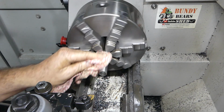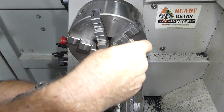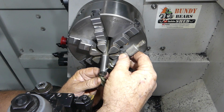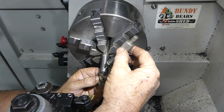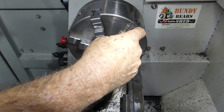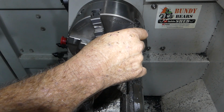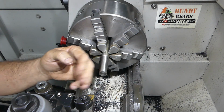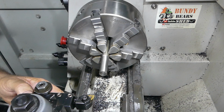Now I know in the past I've tried to just polish a half a thou off, and sometimes it takes forever. So I'm not highly excited about that idea, but anyway, I had to polish it anyway. Yeah, 0.875. Yeah, I guess 658 and a half there. Yeah, there's still a slight variance. We went from being too big here because of the flex to being a little bigger here now. So we've changed a little bit, but anyway, look, let's just go with what we have.